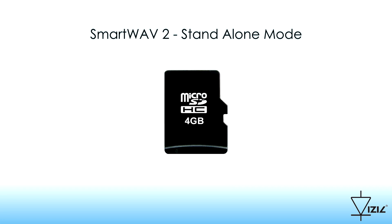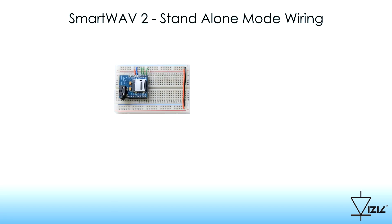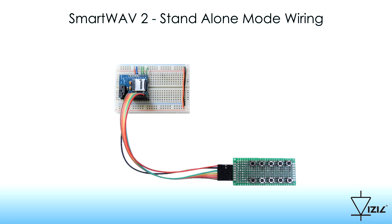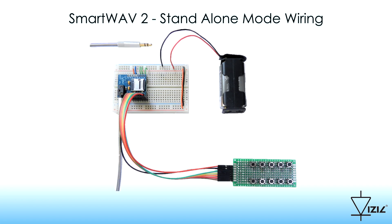For the purpose of this demonstration, the microSD card is loaded with 11 files: 10 WAV files are the soundtracks and one TXT file with the corresponding names of the tracks. Mount the processor on a breadboard, connect the push buttons keyboard, wire the 3V batteries, and finally the 3.5mm jack.